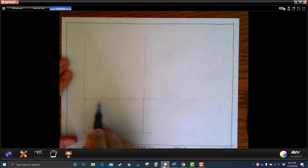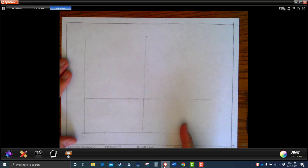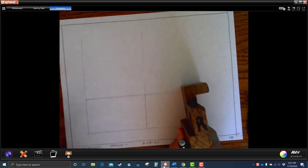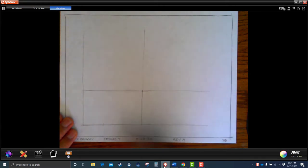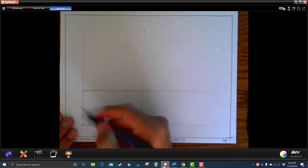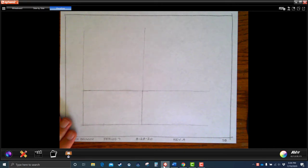We know the height of the front and the height of the side are always the same. If you're 5'7" and somebody looks at you from the side, you're still 5'7". So when you have a part that's a certain height from the front, the height from the side is always the same — it doesn't matter what shape it is. These views are always in the same place; that's the industry standard, so people everywhere can look at a drawing and know what's going on.